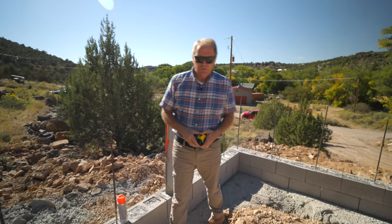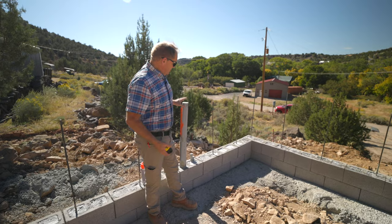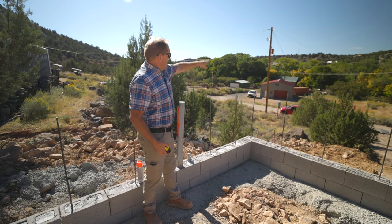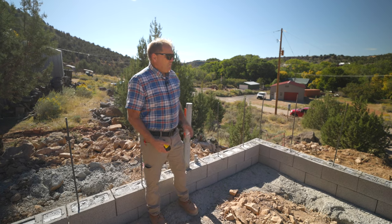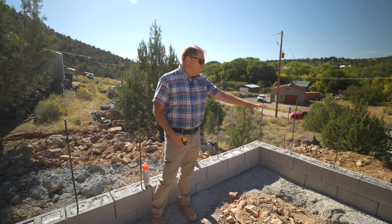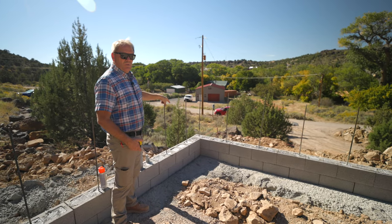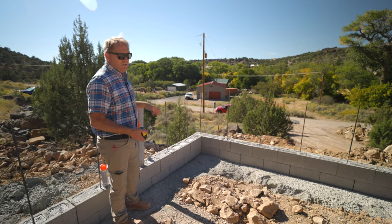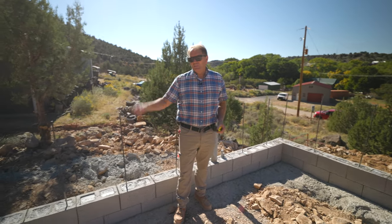This here is going to connect underground to this pole here. A lot of power companies are not wanting to do overhead anymore — they want everything buried in the ground. So this will be buried all the way over to that power pole. But I didn't want my plumber to dig under this footing here, and I didn't want him to dig too close to this foundation corner. That's one thing I just didn't want to weaken at all. He'll dig underneath here and make connection with the septic system.